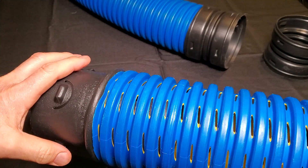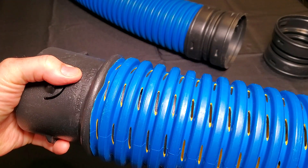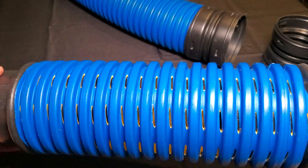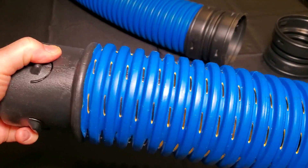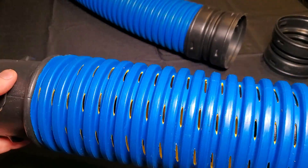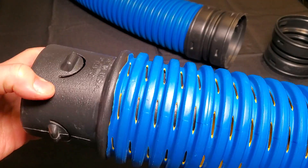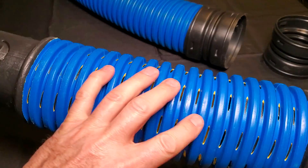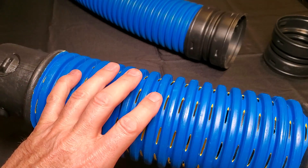It's not coming apart, and then you go ahead and connect your other corrugated pipe to the other side of the coupler. It's never going to come out — you have to cut it out. This is a four-inch internal coupler, and it's for perforated pipe, not solid pipe.